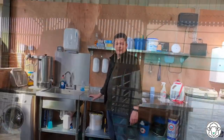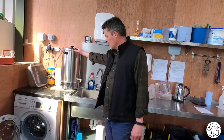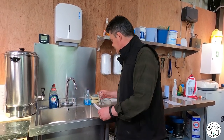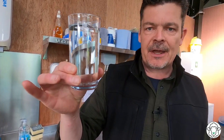Let's start in the lambing area, situated right in the middle of the barn. In here we've got a normal, quite big kitchen sink, a washing machine, and also a hot water boiler — because there's no other hot water in the barn. Just a normal tap really. When you turn it on there's a slight delay because it uses an electric pump to pump the water around the system, but it's still really clear. Because of the way we've designed the system, you really don't get any bits or anything. I'm not saying I'd drink this water — you can put a filter system in-line to make harvested rainwater drinkable — but we only use it for the animals and for cleaning vehicles.